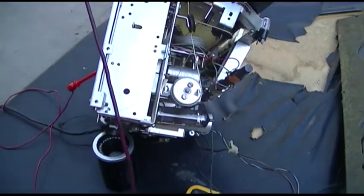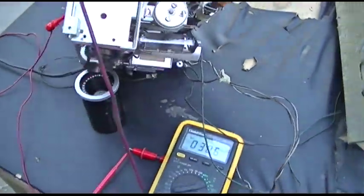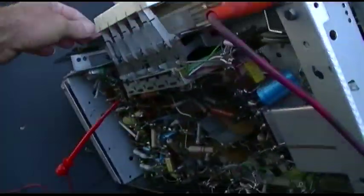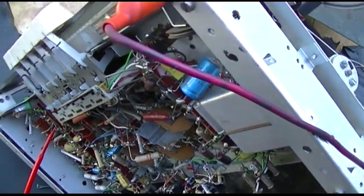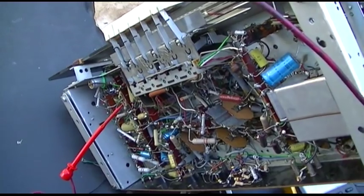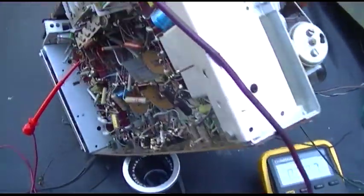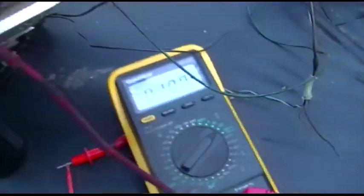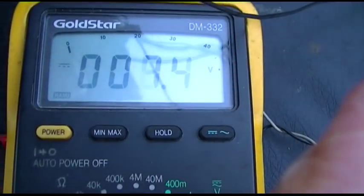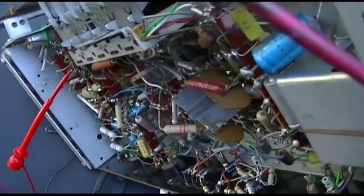Back on the Philips here, you can hear how distorted it is. The other day when I was playing with it I noticed it was really powerless, so this morning I started checking the grid voltages and I got one tube here where the grid voltage is just all over the place. I pretty much got it — you can hear this if I pull one of these tubes out.